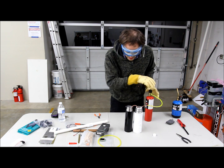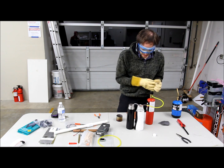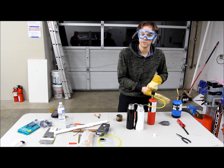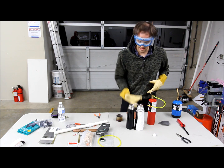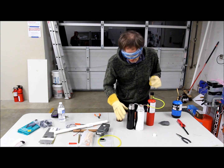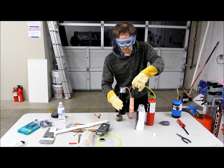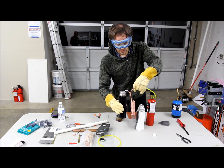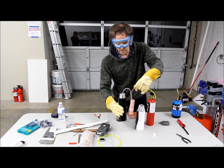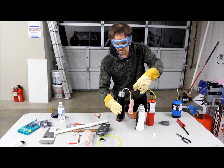We are getting liquid oxygen. I suspect that the oxygen tank is getting very, very cold, so that's causing it to reduce its production. Probably not the best idea to keep it right next to the liquid nitrogen, but we'll call it good. As I raise the nitrogen, it starts to heat up, causing the remainder of the liquid to shoot out of the coil and into the collection cup. That's how you get the rest of it — otherwise it'll squirt all over the table.